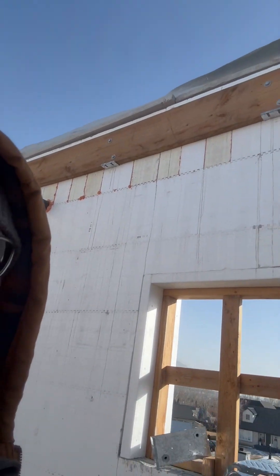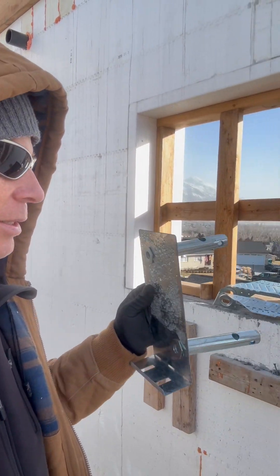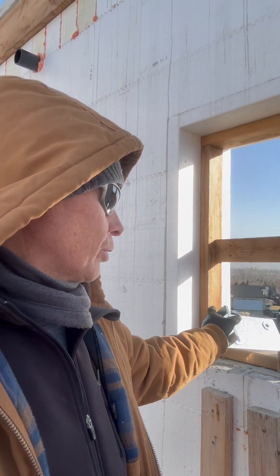For my top level I'm using i-joist roof rafters. Those i-joist roof rafters connect into a 2x12 ledger, and that 2x12 ledger connects into what are called Berman hangers. It's a nice system that you embed into your ICF wall before you pour. The ICF Berman hanger ledgers are structurally engineered and tested to handle the load required once the roof rafters are connected into the 2x12 ledger.